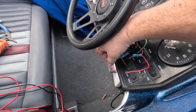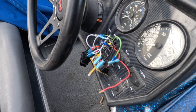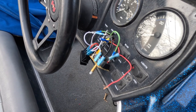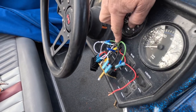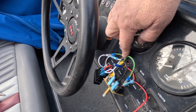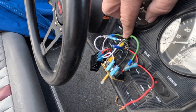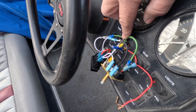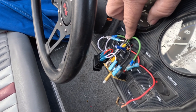I'm going to see if it shuts off here in a second and then I'll put all this back together. I've got it on minimum — should shut off in 60 seconds. I think it goes from one to five minutes. Minimum is one minute to run and then it's off for a minute. Max is one minute to run and then it's off for five minutes, I think. There it went — shut off right there, so that's off. Now we're going to wait just a minute and see if it comes back on. There it went, just kicked on — you probably heard that little click and now the pump's running.